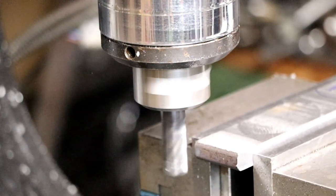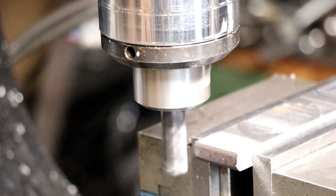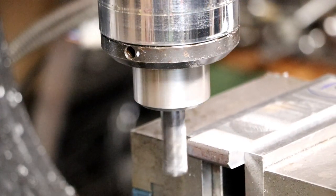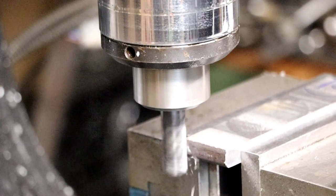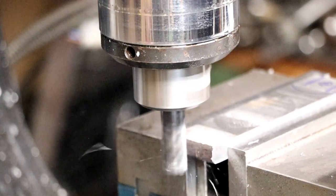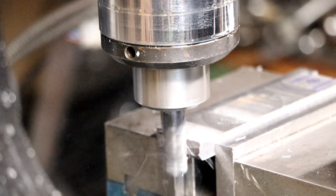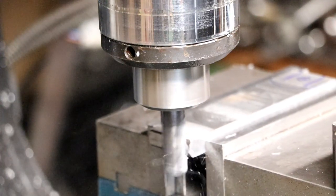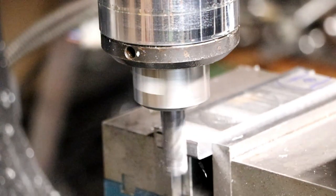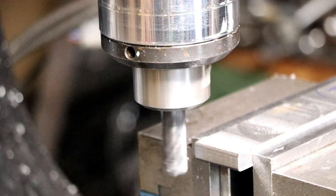Let's touch off, zero the X. I've changed to a 16mm carbide end now. I've also figured out that I'm getting a bit of noise from the motor on the machine, the spindle motor.